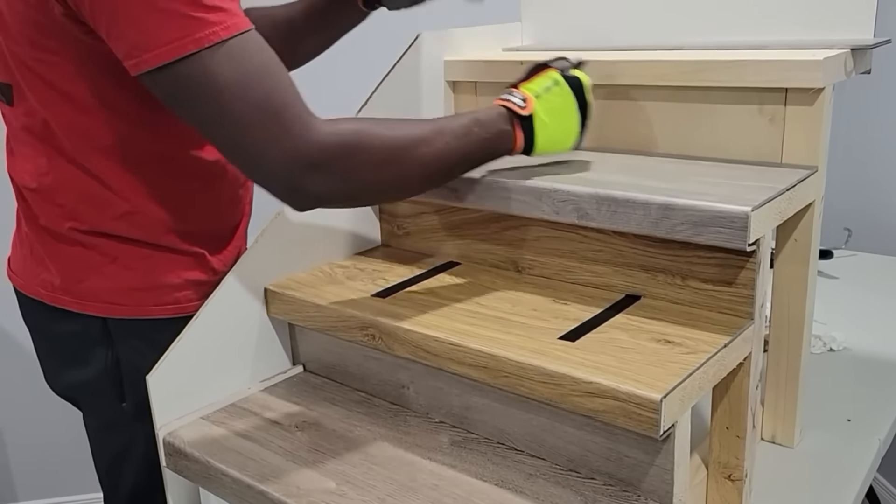The reason we go from the bottom to the top is to make sure that we have the most beautiful finish. The back of that nosing is where that cut line is, and that's now being covered by a factory straight-line finish on the bottom of this riser. The top of the riser has the cut part that's covered by the nosing above it. We do have a video that explains that in detail.